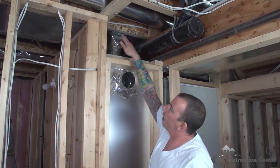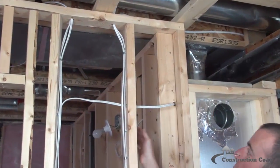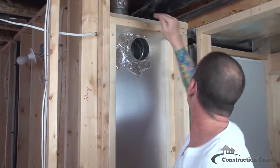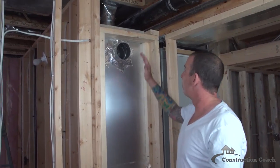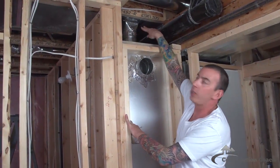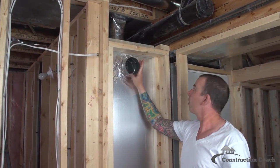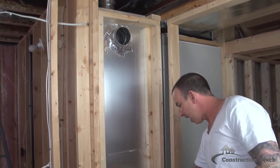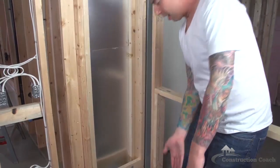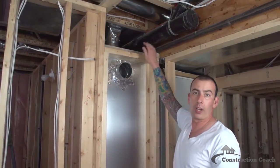Up here is this grey thermal pan plastic — it's a corrugated plastic where they've installed it on the floor joists to create an extension of the cold air return trunk. What I've done here is I've cut an elbow into the existing cold air return. It comes down to this pipe here, sucking air in this cavity from the floor. So when the furnace kicks on, air is going to go in here, up, through here, down the cold air return trunk and back to the furnace.